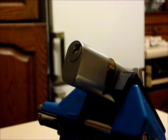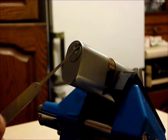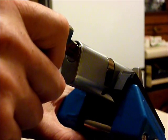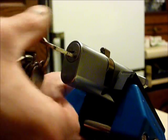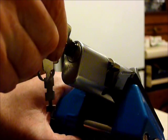The simple reason being is, now and again on some locks you get a ward on there that a key may not go in, and I've found if I file the bottom of the key off a tad, it fits beautifully. So let's finalize this — the cam turner goes in and you rotate, pushing in nicely. As you can see there's great movement there, and that has now finalized the picking process.